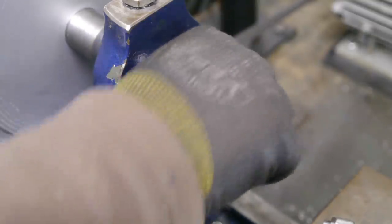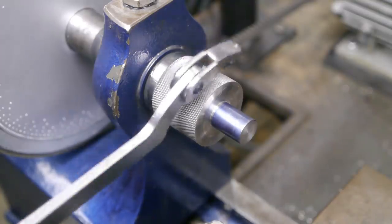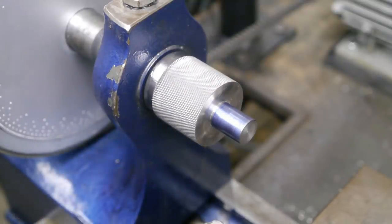At the moment, this wannabe drill chuck arbor is securely glued to the spindle nose. It's just not coming off. For that I need to make a cross drilling jig so I can drill some holes for my hook spanner. But you may know that my attempts so far at making a cross drilling jig have not been very successful. So I won't be able to set up a B16 tapered arbor between centers and use that as a reference to set up the correct angle on the lathe top slide. So I've come up with a different method to set the top slide to more or less the correct angle.